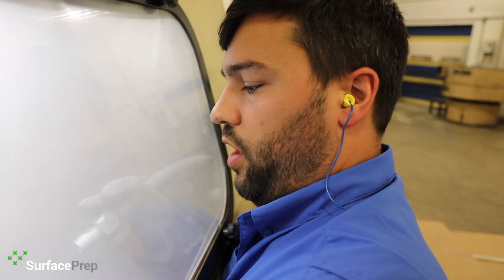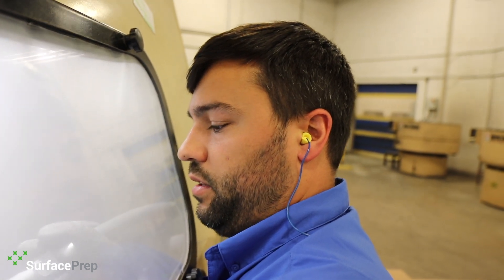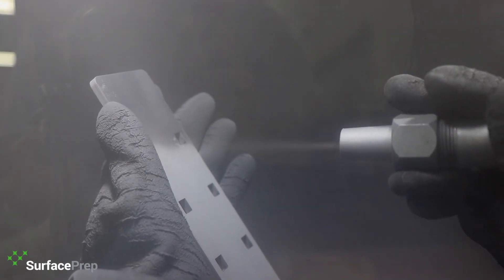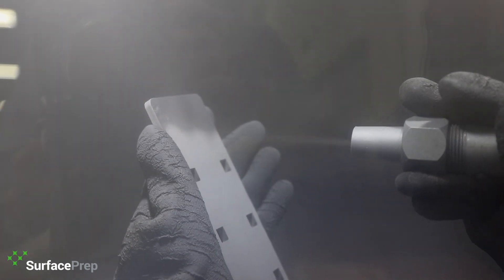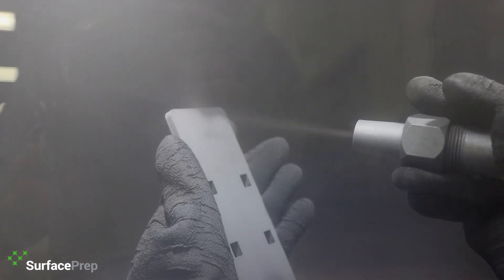What I'm trying to do is remove all of the oxidation and all the loose material from the steel, as well as giving it that anchor profile. As you can see I'm going from a dark surface to a nice light surface — that's the easiest way of showing someone visually the change as I blast this part. I'm going back and forth, always trying to maintain a good angle so that I can get the best out of the media as I'm blasting.